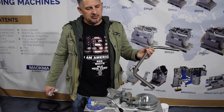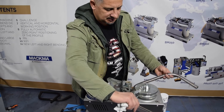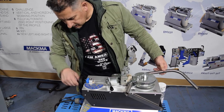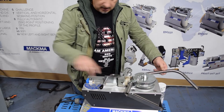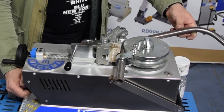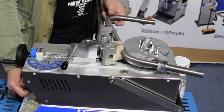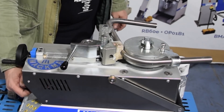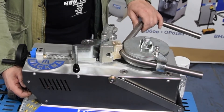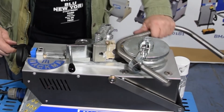So now what we will do — we will not lose this bend because we can also put the pipe back inside where we have been before, and we are going to finish this bend. We close here, go to 103. And we will finish the bend — hold on the pipe till you get the tension. Now we can finish the bend. Opening. We haven't put away any waste; we are still using the same pipe.